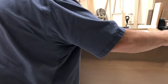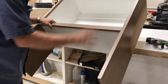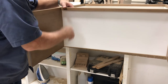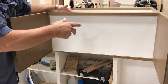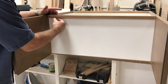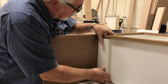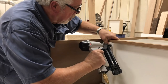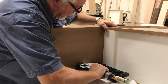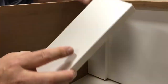Now we have one last thing to do. This is where our microwave goes and this is the cabinet up above it — here I'm going to put in a cleat. As the microwave goes in, this will allow them to anchor the microwave top or bottom depending upon the microwave anchoring system and gives them something to push against. I have a three-quarter inch overhang here and I'll put a three-quarter inch thick, four inch wide cleat. Here's our anchoring cleat — I put a banding on one side to make it nice and clean. We're going to stick it right here in the corner and anchor it with inch and a quarter nails — flush, flush. The microwave will sit right in here, and now we'll do that to the other side.